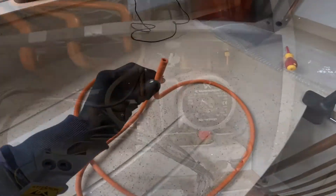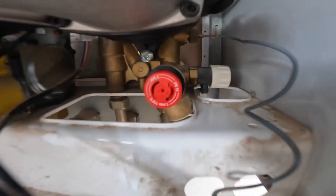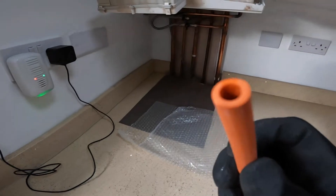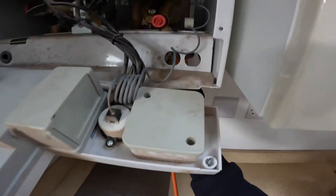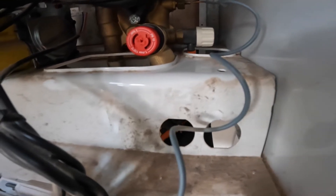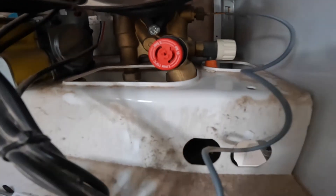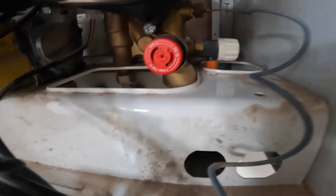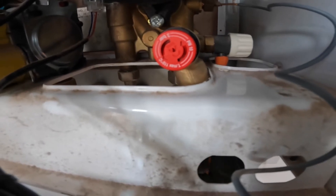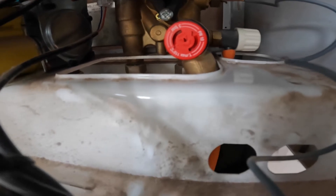You don't need to drain the whole system, it's only the boiler itself. Attach your rubber hose pipe and simply drain the expansion vessel and any water within the boiler. There's no point going around the whole house draining all the radiators — you just lock off your flow, turn off at the bottom of the boiler, and drain from this point. Attach the hose, open the drain off, turn the white locking cap, and release all the water into a bucket or sink.